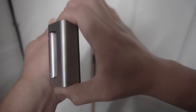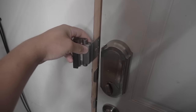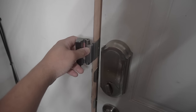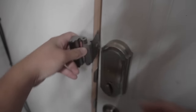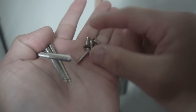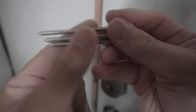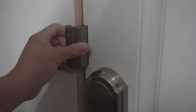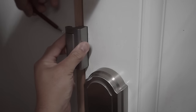Installation is super simple. Pull this back out to the unlock position and sandwich it between the door and the door jamb. If you have enough clearance, then you are good — you don't need to chisel out or relieve any part of the door jamb. But if you're having a hard time wedging this in, mark where it's located and chisel out about a 16th of an inch, which is about the thickness of this, and then install it. This comes with hardware — the half-inch screws are if you're installing this inside your home, but just settle with the 3-inch. It's very important that you use the 3-inch screws because these are the most important ones to hold this lock. For me, I'm going to install this right on top of my cipher lock. When you figure out where you want to install it, make a reference mark on the door jamb like so, and also mark how deep you are going to be installing this.